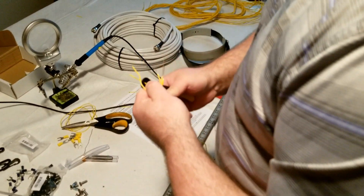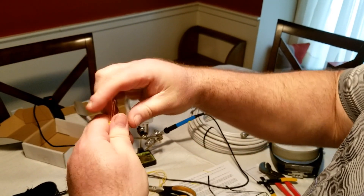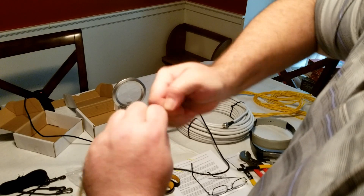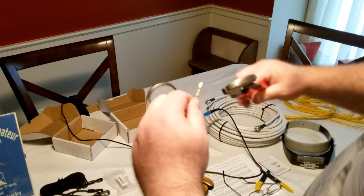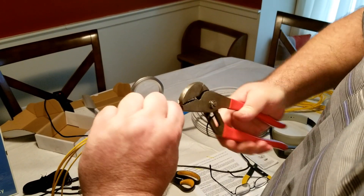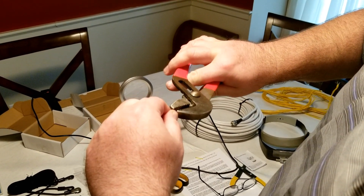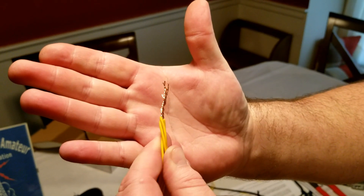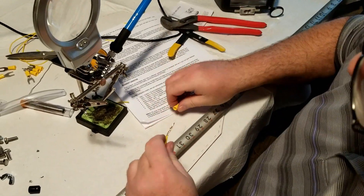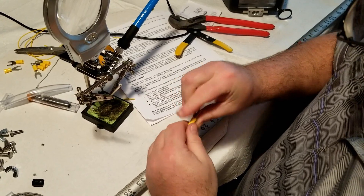The kit comes with D10 wire, which is a very decent wire. I wanted to save that black wire for the elements, since I knew I was going to be putting up an 80 meter inverted L doing everything pretty much at quarter waves, and I do have a full length six meter. So I bought this thin inexpensive yellow wire — I think it's technically for invisible fences for dog electronic collars and things like that. It's cheap and easy to work with. So I set it up, did the crimping and the soldering. Simple work — I'm not an expert and I don't have all the right tools, but you can make it happen. Just take your time and have some fun with it if you like to be a little hands-on.